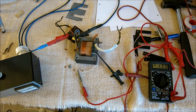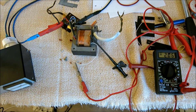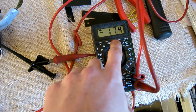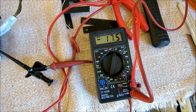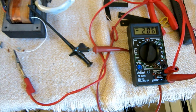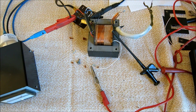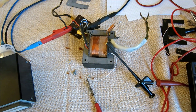After several hours of careful unwinding and putting back together, testing it and making sure I'm not removing too much wire, I'm finally at the point where all the math came out right. We're having 230 volts on the input and the output is reading around 176 to 174 volts — about 5 volts low from what we originally wanted. But better 5 volts low than 5 volts high; it was 30 to 40 volts low when we started out, so this should be a good improvement. One final time I'll take this apart, then put on the covers and insulation sheets, put it fully back together, install it, and we'll see what it does.